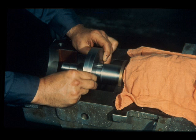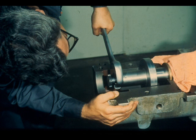The thrust collar is installed next. Make sure both faces are clean and are properly oriented. Then slip it over the shaft, onto the key, and seat it against the shaft adjusting shim. Secure the thrust collar with the lock nut. The workman scribed the thrust collar and the lock nut during disassembly, and he is now tightening the nut until the two scribe lines coincide.